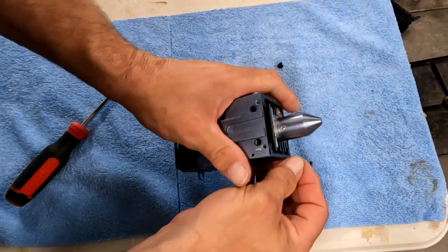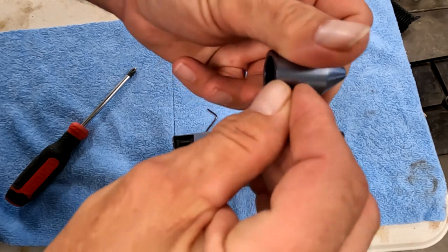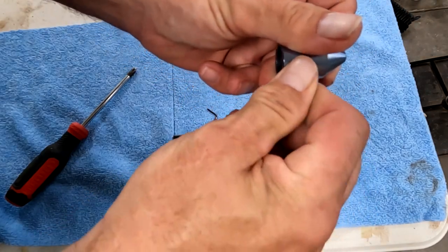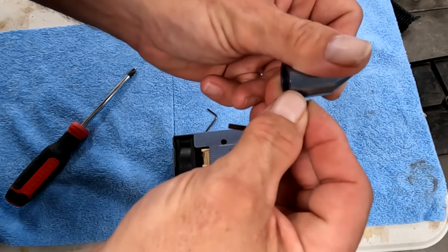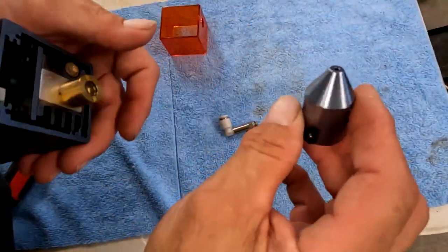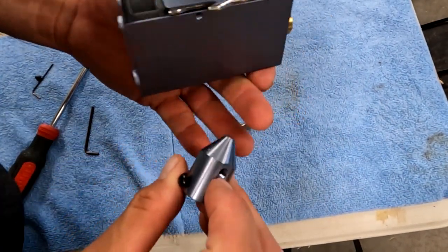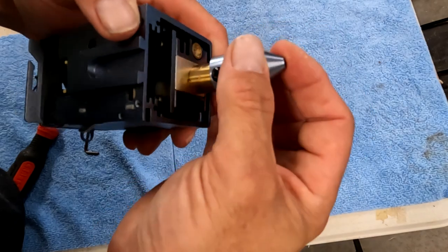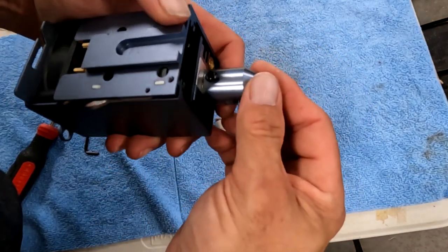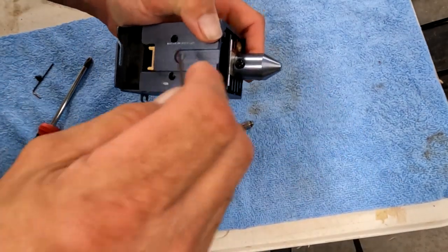The next thing we want to do is take the nozzle. You'll see there are two screw holes at the top and one bigger screw hole at the side. The bigger screw hole at the side is where the air nozzle goes and the tube hooks. You want to line up with the side where the tube goes up through, like I've got in the picture. Basically, you'll have one set screw at the top and the nozzle will come out of the side. I'm going to put a screw in here first just to make it easier to tighten down while it's not on top of the unit.